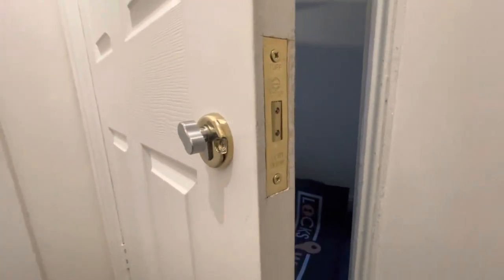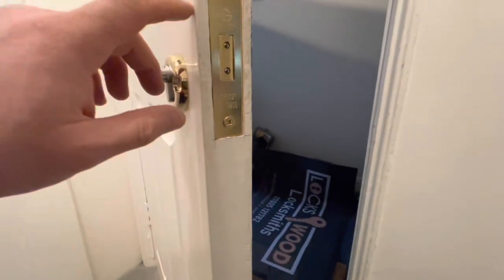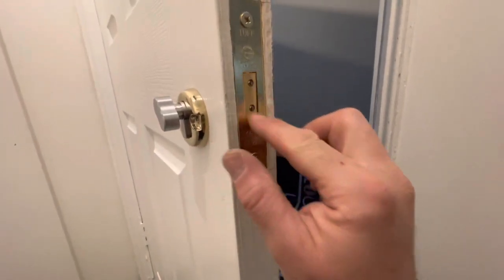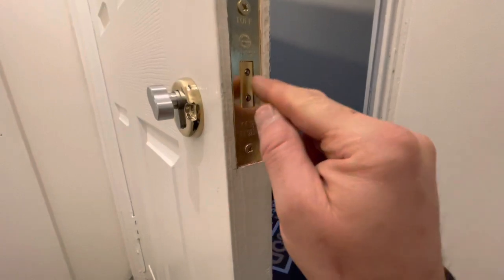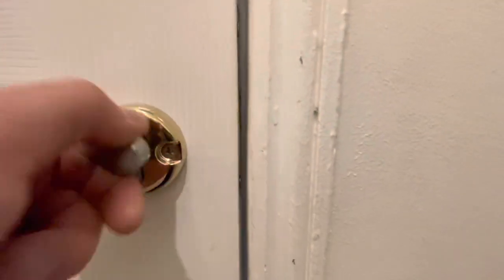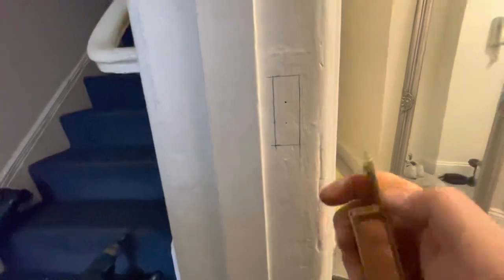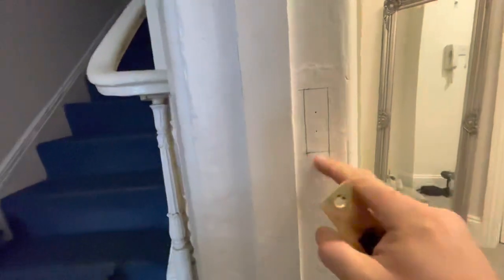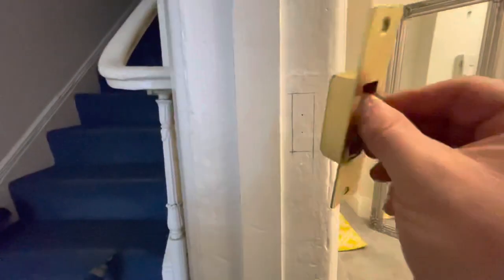Now, to mark the keep. There are loads of different ways you can mark the keep on the frame. This is the keep that's going to go in here. What I've just done is mark with my tracer pen — you've got the pencil and then you've got this black marker. On this lock there are two little ball bearings, like an anti-drill ball bearing. I've just marked the end of the bolt and thrown the bolt a few times, and it's given me two little marks on there so I know exactly where the middle of the keep has to go. So that's the box part of the keep marked out — we'll get that cut out. Leave yourself a little bit of space; you don't need it too tight. Once we've cut this out we can slide that in and mark the faceplate.